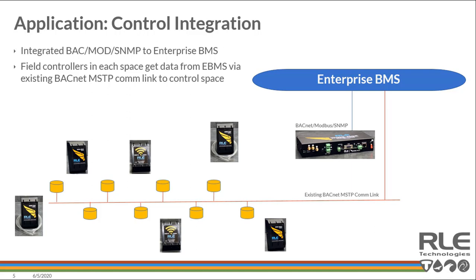Being able to leverage wireless even in a hybrid approach covers a lot of jobs that have been implemented but maybe didn't quite get all of the CO2 monitoring, or some additional temp/humidity sensors, or extra door contacts, or a smoke sensor to put in a different space as a secondary alarm to a security panel. All of these are options to deploy to really optimize system performance inside of building automation.